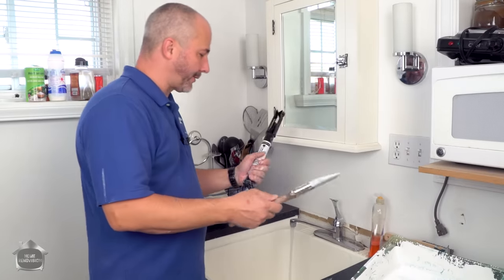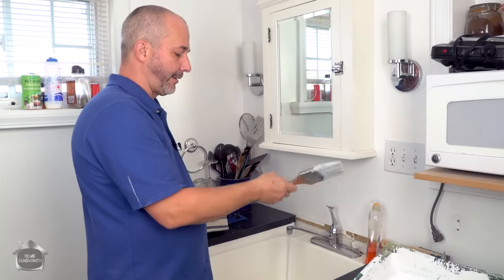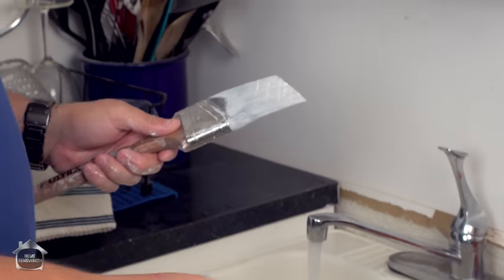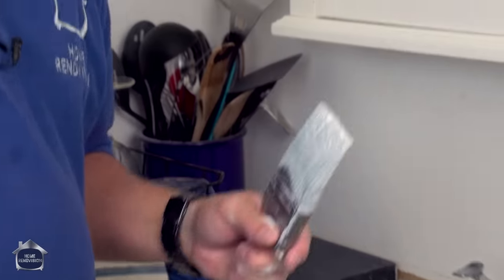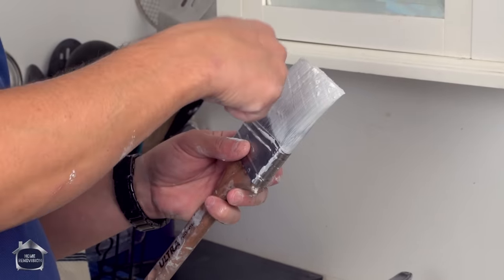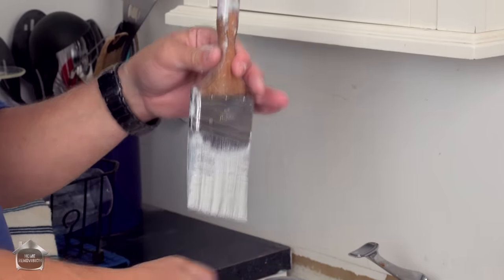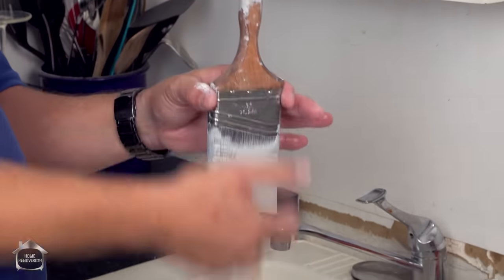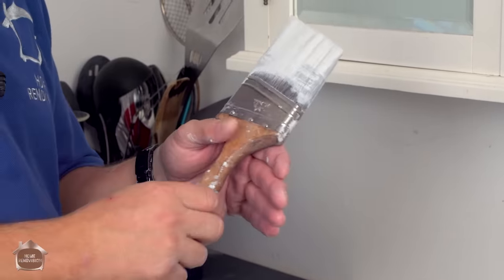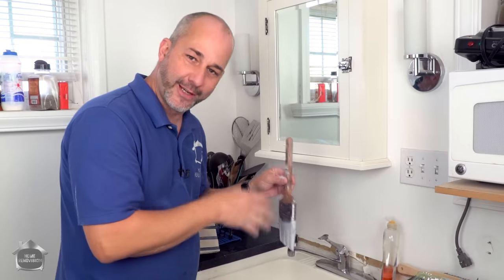The spinner also is an attachment. You can put your paintbrushes in it, okay? And it does exactly the same thing with a paintbrush, but it's not really necessary. For washing a paintbrush, let's just talk about this for a second. Washing a paintbrush is actually an art, because when you're working, you're trying not to let paint get all the way up to the top, okay? Which is why it's nice to have a pail with a magnet on it that holds the paintbrush this direction, or you leave it in your paint can sitting straight up. Try to avoid leaving it across the top, because then paint will end up running inside the brush. When you're washing, you don't want to wash it upside down. You want to wash it in the same direction you're carrying it.